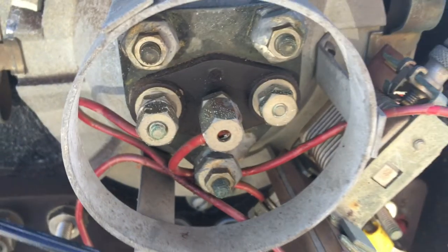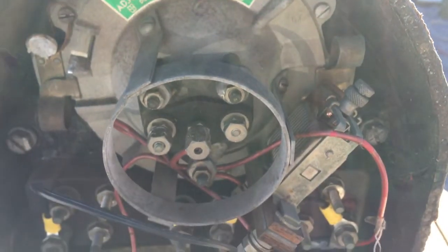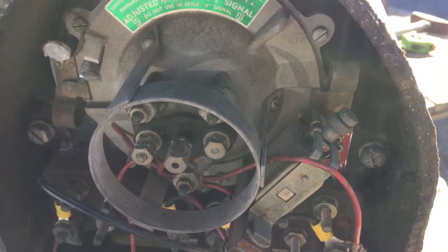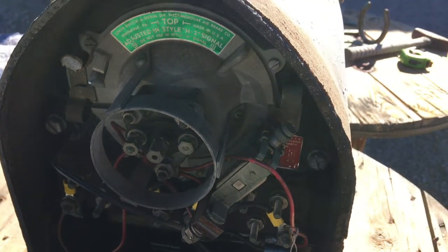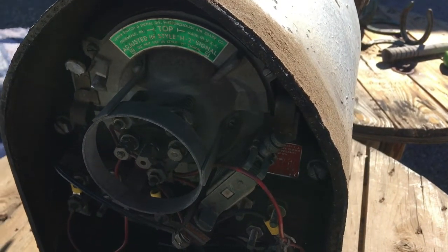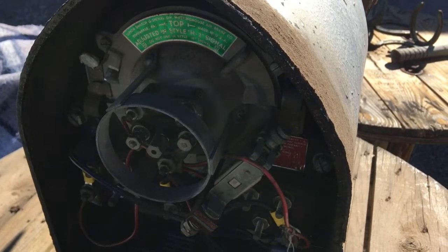Now, towards the end of the video, we get into the lunar part of it. Oh, and I forgot, you see the box on the bottom there, the AC adapter. This light has been modified so you can plug it into 110 volt, and it's working off of 110 when it normally works off of 12 volt out there on the railroad line. This light was probably built in the late 1950s. I think it said 1959 on the light. So again, this light has been modified. The AC adapter has been added. So that should clarify we're working with AC. 110 is coming in, but the adapter then knocks it down to 12 volt DC. Okay, let's get on with the video.